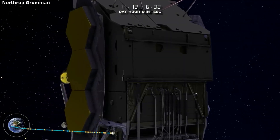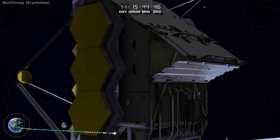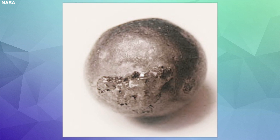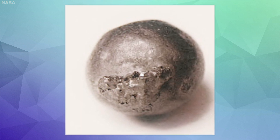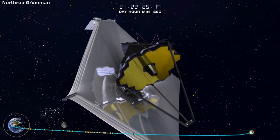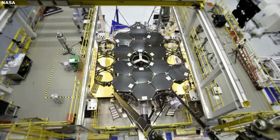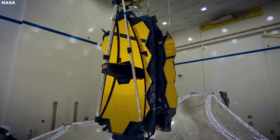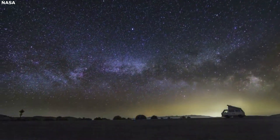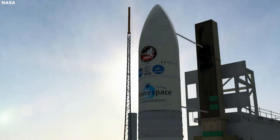The last feature of the JWST that I want to mention is the materials used on the mirror. This includes the primary material along with the gold plating on top. Starting with the primary material, each of the hexagonal mirrors is made from beryllium. This is a light metal that has a long list of properties perfect for Webb's application. The first benefit is high strength along with low weight in comparison — whenever launching anything into space, these two factors are very important. This metal is so strong and lightweight that it's often used to build parts for supersonic airplanes or rockets such as the space shuttle. The next is the metal's ability to hold shape and strength through a wide range of different temperatures. Beryllium is also a good conductor of electricity and heat, and is not magnetic either.